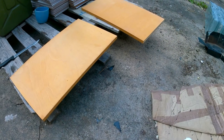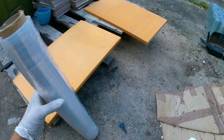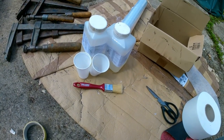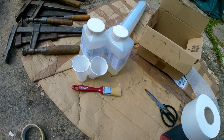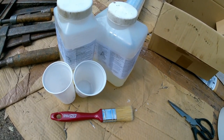What we need next is a press and some packing material. I decided on these two simple wooden boards and about a bazillion screw clamps. To mix the epoxy properly, it is recommended to have multiple small containers. The epoxy I chose for this is usually used for boat construction. It takes about 360 minutes to harden.